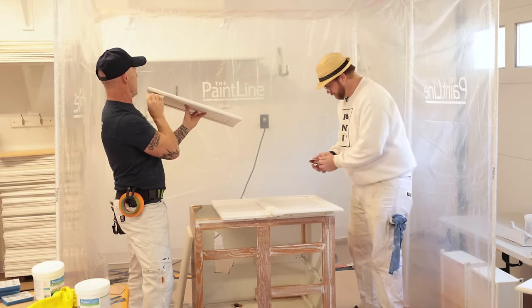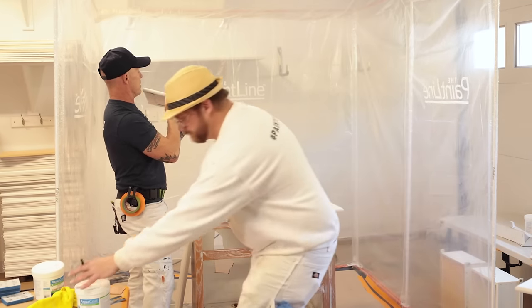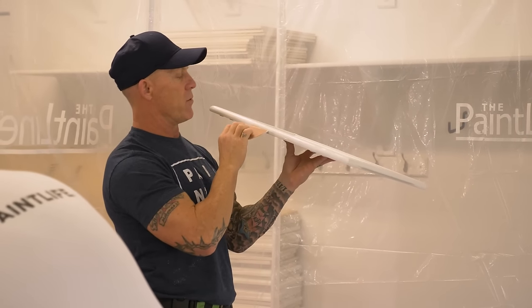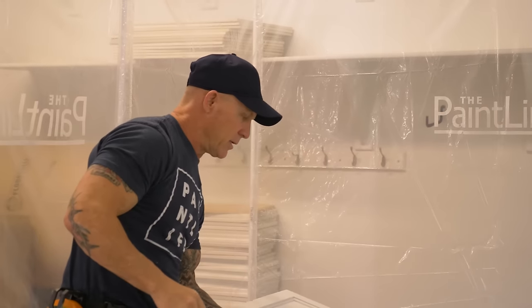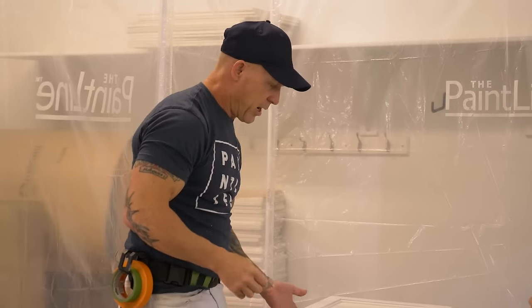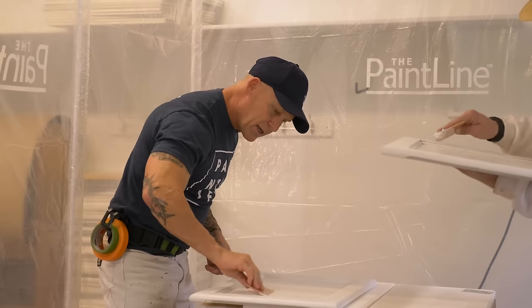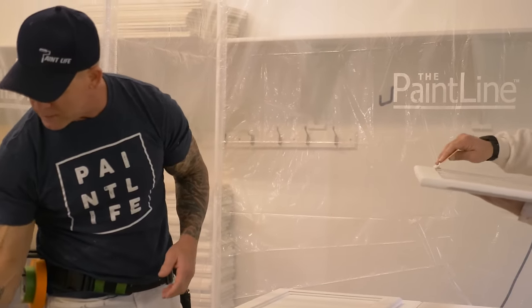You know, Michael's customer said they're just adamant these are going to be caulked. So the panels are going to be caulked. That's what they desire. So it's really ideal not to get Aqua Coat in the floating panels and the gaps. It's better to use caulking because the caulking is more flexible.